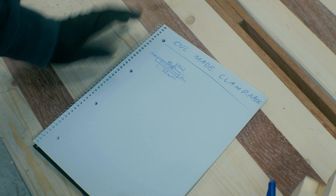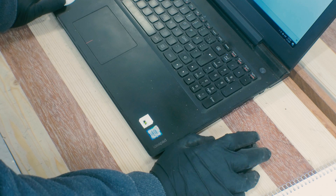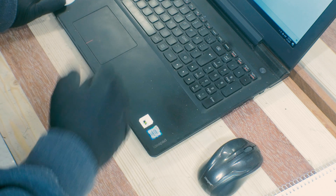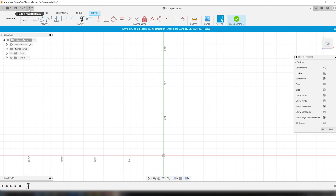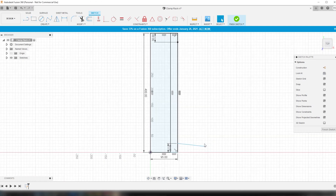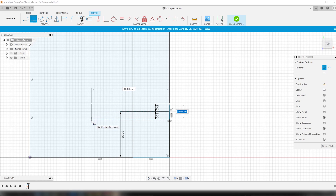These brackets I'm also going to make out of the same material. Let's go into Fusion 360. I'm not going to go into detail on how I design this in Fusion, but I will show you a time lapse and give you the most important information. I start by modeling the main rack, which is going to be 95 millimeters deep and 40 centimeters long. The first clamp slot is going to be 30 millimeters from one of the ends, and the slot itself is going to be 10 millimeters wide and 75 millimeters deep.